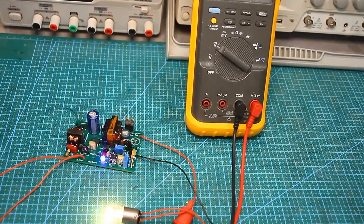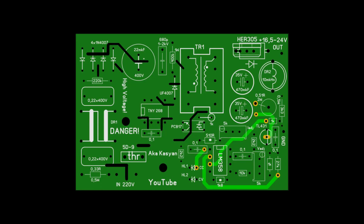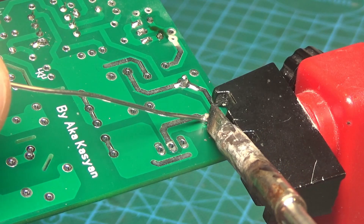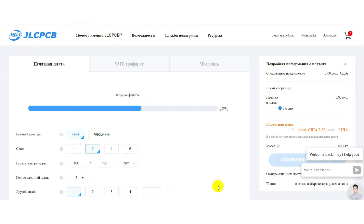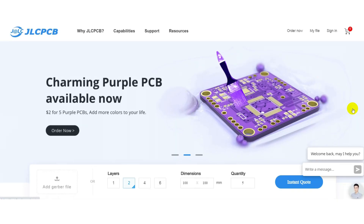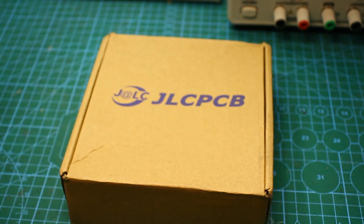It should be noted that there is an error with the connection of the optocoupler on the board shown in the video — I re-did the initial versions of the boards a long time ago, correcting all the shortcomings. The boards turned out very nicely, maintaining proper wiring norms for impulse sources, observed clearances, and milling at places with possibility of spark breakdown. Gerber files of the new boards will be in the archive of the project. You can download the Gerber folder and upload it to the website of our sponsor JLCPCB, pay for the order, and get universal charger boards for almost any screwdriver — easily recalculated for different voltages and currents. The link to JLCPCB, which will make boards of excellent quality in any complexity and size, will be left in the description.